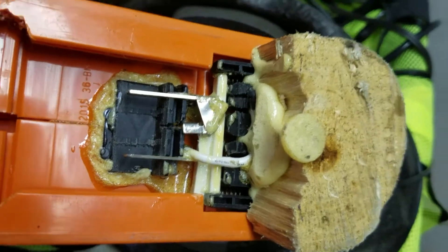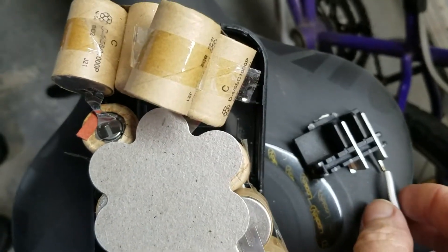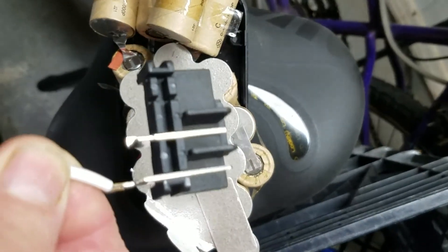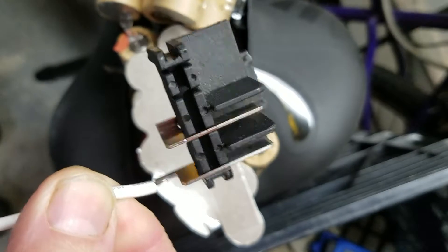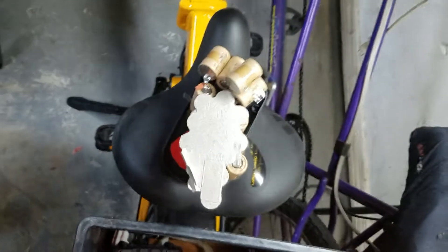So you see how this wire goes up and over to the other side — you have to reverse the polarity. To start out the process, first you have to take apart your battery pack. This is the old 18 volt. You have to have the little bitty tool that unscrews those hex nuts, and this is the part that you need from the battery — the old power plug — and it requires some modification.